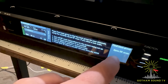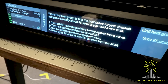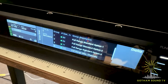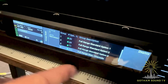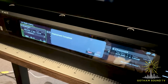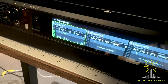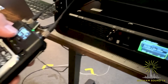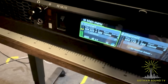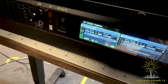It tells you right here — using the currently saved RF scan. If you need a new scan, it tells you how to do that. So we're going to find the best group. It'll go through the options: full range, max channels. Deploy — and as simple as that, we deployed it to the transmitter unit. And because the receiver is over ShowLink, it should sync up automatically. We have 568.825 MHz as the one it picked — and we see that exactly on the front panel as well. Of course, you'd do it for all your channels or frequencies if you have more than just the one.